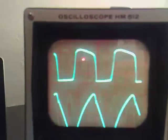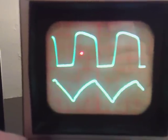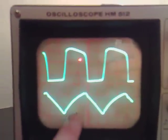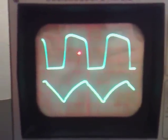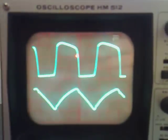If I bring the time base back down again you can see when the current is kicking in with the voltage, and that will be the area under the graph which is the actual current going in. Because it's a pulse circuit, the same applies — it's the area under the graph which will be the voltage.